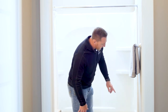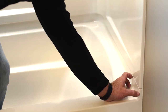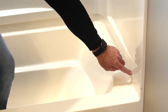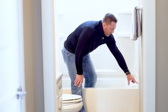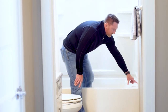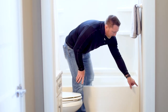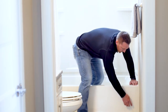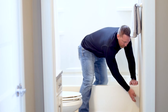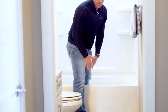Now, there is one area in particular — from the front edge there's a small little drip area, about four inches in length. That area is sealed on install with a silicone caulking, and that basically keeps the water from channeling out the front of the unit, possibly getting behind the drywall, and then damaging members of the wood framing or the drywall behind the wall that you can't see.